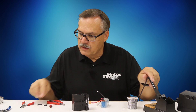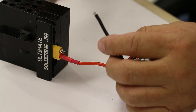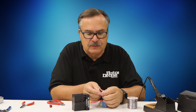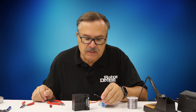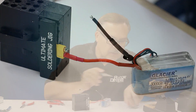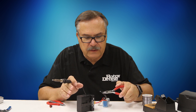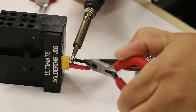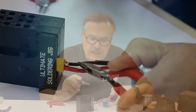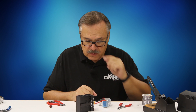It's probably easier to put the shrink tubing on first before you start heating things up — do as I say, not as I do. I'm going to add a little more solder onto this pin for a better buffer, put some fresh solder on there, press it on and let it melt to get a nice little bead right on there. These XT60 plugs have a nice little groove in there that makes it easy to solder to.